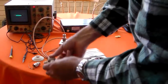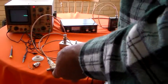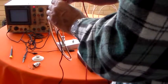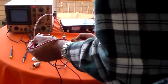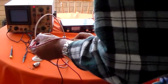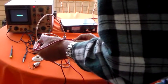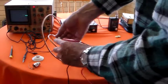What we're going to do is set the impedance. I'll just give it a higher value — maybe it'll be easier to do it there. It's times ten, so I'll set it to five hundred. There we go. So that's now 5000 ohms, and the tuner is going to see 5000 ohms across the output.